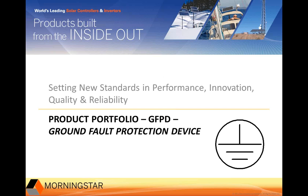Ground fault protection is used in electrical systems to prevent current from following any unintended paths. It's critical to detect any stray currents and to interrupt or break the circuit until safe operation can be restored. Any current imbalance between the sides of a circuit indicates a ground fault. Morningstar's GFPD, or ground fault protection device, will detect this condition and break the circuit on both the positive and the negative legs.